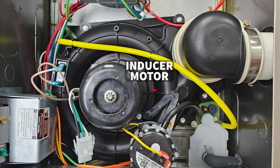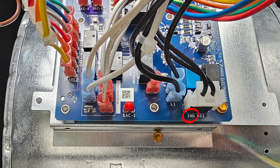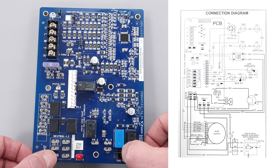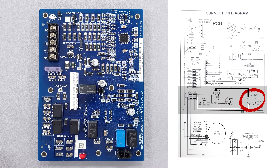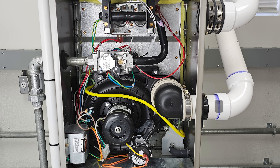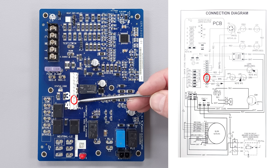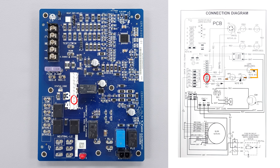The pressure switches are there just to prove that the inducer motor is running and also that the condensate line is not clogged. The very first thing that's going to happen is the inducer motor - right here IND on this circuit board. You're going to have your 120-volt hot and a common over at your inducer motor, and the circuit board is going to apply power to that inducer motor. After that, it's going to look to see if the pressure switch is closed - that's an air pressure switch looking for a differential in pressure applied by the inducer motor in the heat exchanger area to carry the exhaust out of that gas furnace. The pressure switches are found between the third and fourth pin on this circuit board.